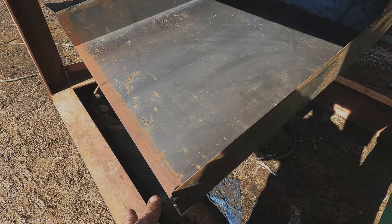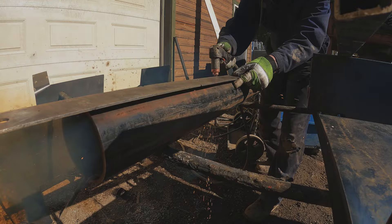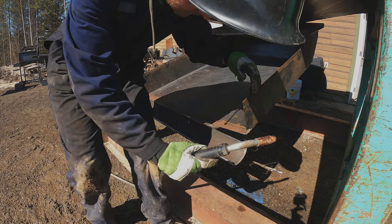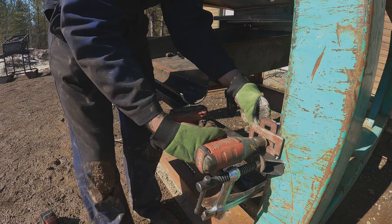This nugget trap is also going to act as a brace from this point to that point. For the nugget trap we'll be using a four-inch pipe — I'll cut this right down the center and only use half of it. Right now I've got the crossbar tacked onto the sluice. I've got these pieces made up so this will actually bolt to the frame of the trommel. Now we'll cap off the ends of the nugget sluice.